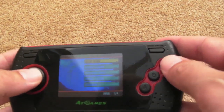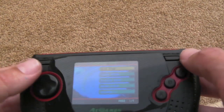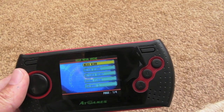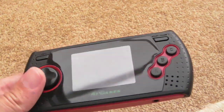And I think it's the ROM — I think the ROM on here is either corrupted, or because it's BGA it's off the board. So what I might do is take this to pieces, remove plastic components, and get my hot air gun onto that ROM chip to see if I can reflow it.